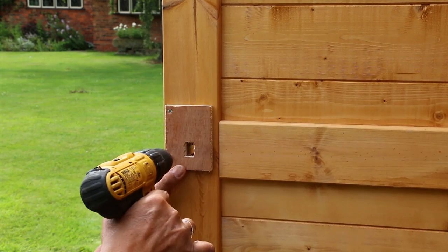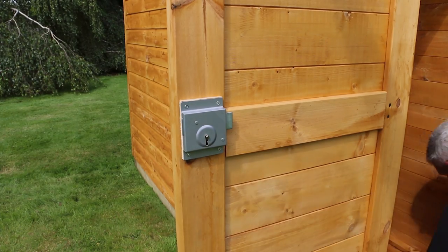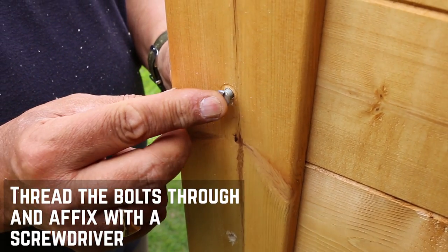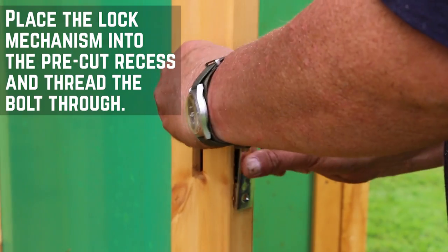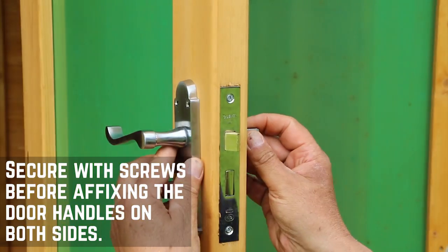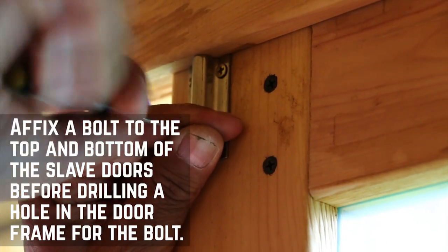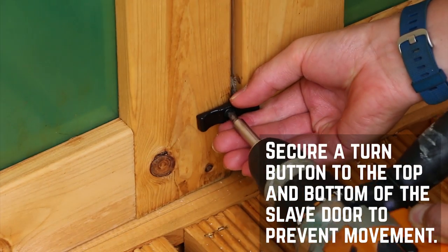The next step is to fit the locks and door handles. Position the lock mounting plate over the pre-cut lock hole and secure with screws into the door frame. Secure the lock over the plate in each corner. The door stop needs to be placed over the lower corner and screwed into the framing. Use the spirit level to mark out holes for the door handle, then drill through to allow space for the bolts. Thread the bolts through and affix the door handle in place with the screwdriver. Place the door lock into the pre-cut recess and thread the handle bar through the mechanism. Secure the lock plate with screws before affixing the handles over the bar on each side and screw these down to the door. Affix a bolt at the top and bottom of each door before drilling a bolt hole into the framing to secure the lock. A turn button should then be installed on the top and bottom of the slave door.